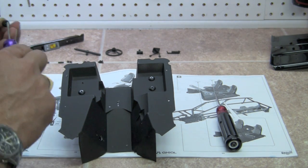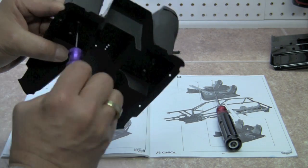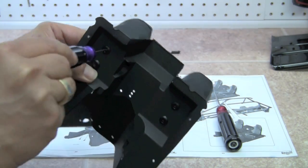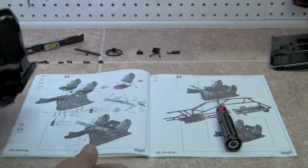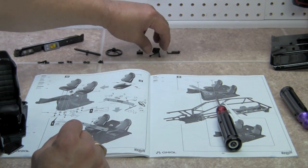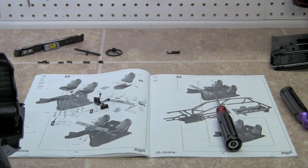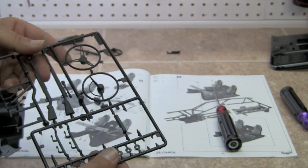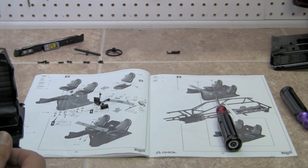So we're going to put this together. The next part that we're going to work on is putting the shifters in. And there are two shifters — we have a double shifter and a single shifter. We're going to put both of those on. One thing I do want to mention is all of these parts are on the same rack. The part numbers on my manual are wrong, so we're just visually going through and looking at each piece and putting them on. And it's working out well for us — we didn't run into any surprises.